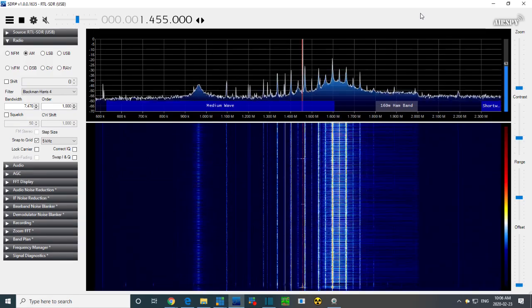In this radio, the only way to adjust the front end tuning point, there's no trimmer for it. So the only way would be to bend plates. I'm not about to start that. So an easier thing to do is to move the local oscillator to line up with this radio. Holy smoke.